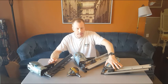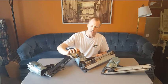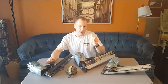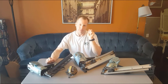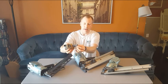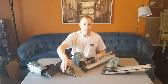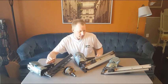The next is the palm nailer, which is for getting into really tight, confined spaces. It does the same thing as a hammer tapping a nail really fast, but in spaces where you don't have much ability to swing a hammer. You just put the nail in the end, push it against the wood where you want to drive the nail, and it hammers it in. It sounds like a machine gun going off — pretty loud — so you want ear plugs if you're working inside.